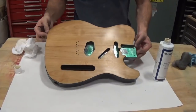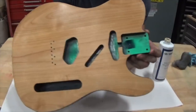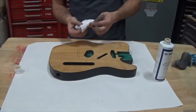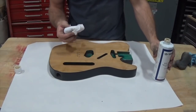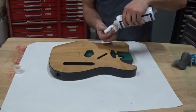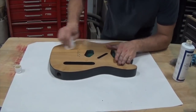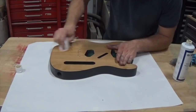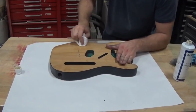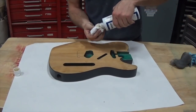Right now after that I've abraded the surface back to basically a satin sheen, and now I can take it up to a gloss using this polish, my rag, and a lot of elbow grease. I'm not going to have you watch me do the whole thing because it is going to take a while. We'll do a preliminary polish on a small area so you can see that, and then we'll come back when it's done and you can see what it ended up like.